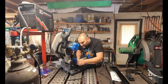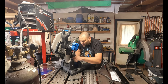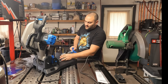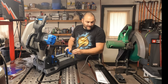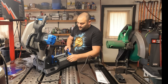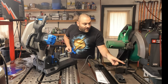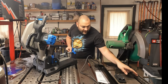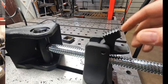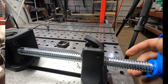On the joint that is a really nice machine joint — it's got thrust washers, a really big spring. That slides a lot smoother than the other saw over here. And it's an acme thread. That saw does not have an acme thread, that's just a plain thread. This actually has an acme screw so you're going to get a lot more clamping force and a lot more surface area.